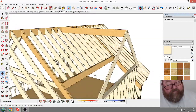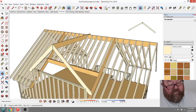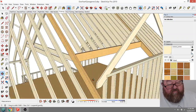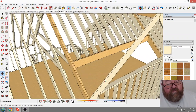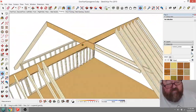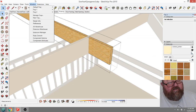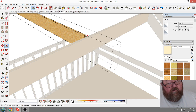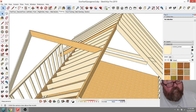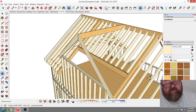And then what you'd have from there is, let's see, this roof would be built on top of this one. So you would go ahead and deck that part. Let's fix this ridge, because it would only be coming back to here, right there. Like that.